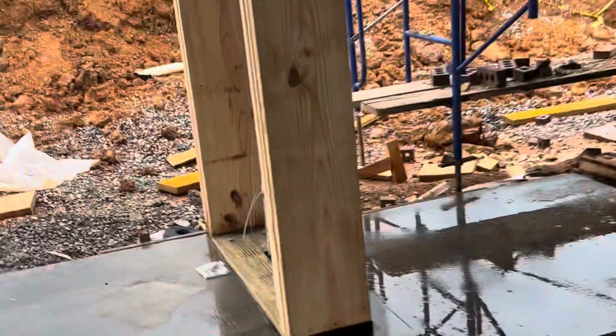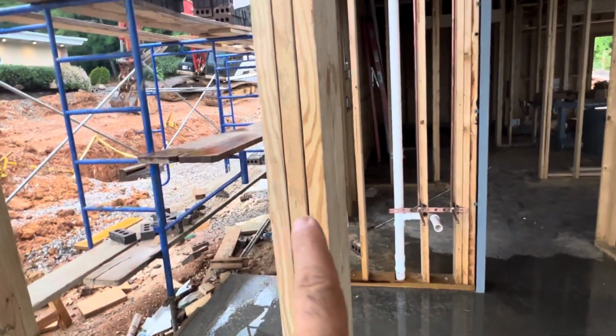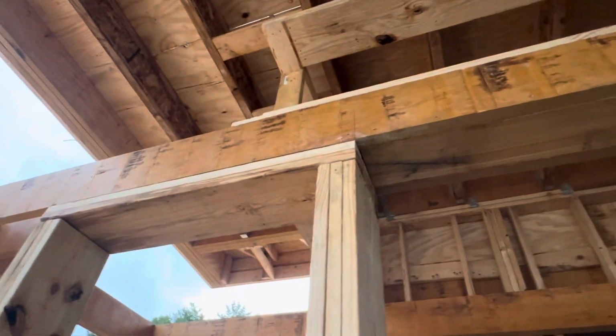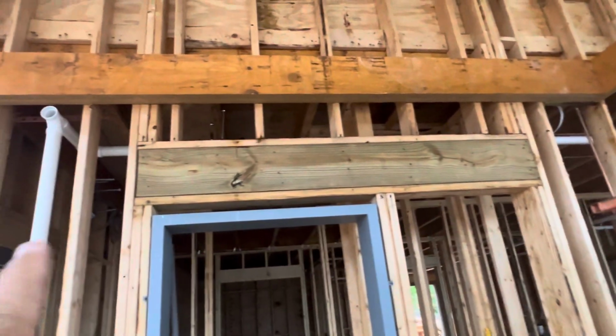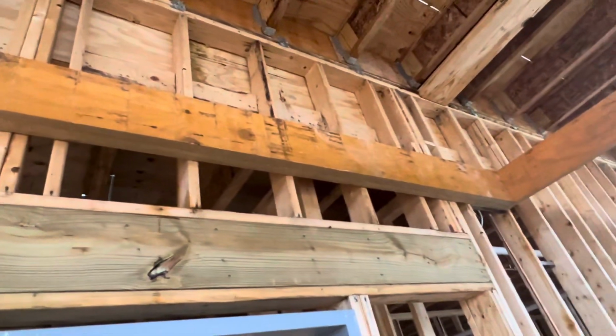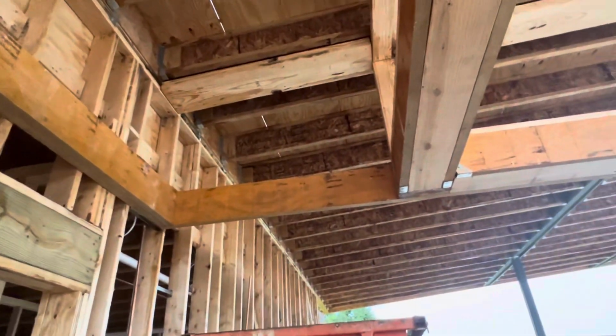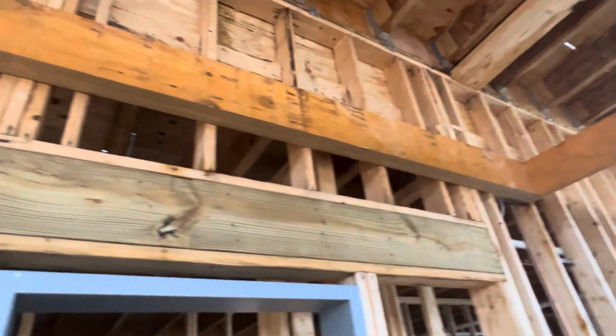Okay guys, LVL, and here you can see we have a pressure treated 2x12, and then 3 yellow 2x12, 3 and 3, and at the top there is 2 to carry that LVL. Same thing here, we have 3 studs, 2 and 3, and to carry, and that's pressure treated. So that's about framing work, wood stud framing. It's great work. Everything is tied together.